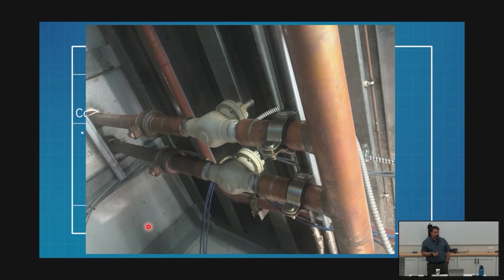Most of the solenoids, okay, when I say most, every single solenoid we touch except these are normally closed. At rest, you cannot blow through it, right? You have to energize it to open. Normally closed. These two solenoids are the opposite. They are normally open. You pick them up out of the box, you can blow right through them. You have to energize them to close. Exact opposite. So weird. Why is that? Because you don't want it to close.